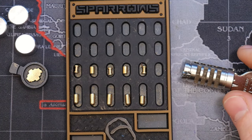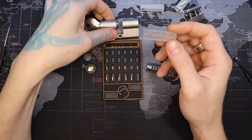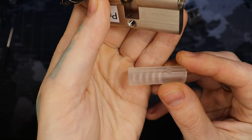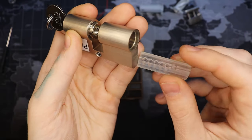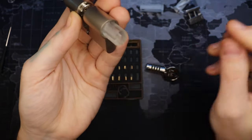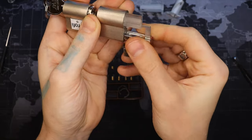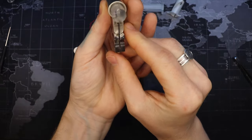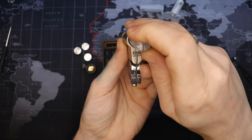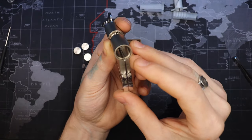I want to show off some of these 3D printed accessories real quick — really cool. These are front loaders for reloading Euro cylinders. This one has all the holes in the top for the pins and has this little stopper here. You put all your driver pins in there, the stopper stops right there, push them around and line them up with the Bible there. You put your pinning shoe in like that — it fits right inside. You pull that out and your pinning shoe stays in right there on top of your driver pins.